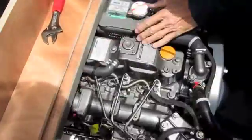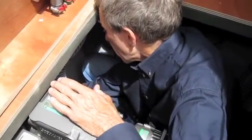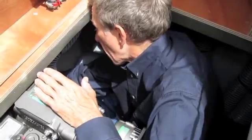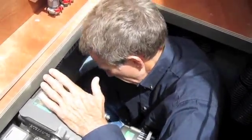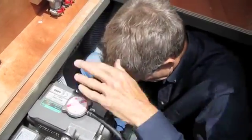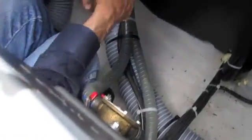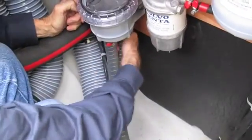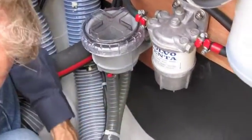Check the saltwater system. The saltwater comes in the valve on the sail drive. Check that the valve is fully clockwise open all the way to its stop. Squeeze the hose, check the clamps, check the hose all the way up to the saltwater strainer. Check the hoses, give them all a good squeeze and pull. Make sure no clamps are loose, no hoses are loose, no sign of leaks.